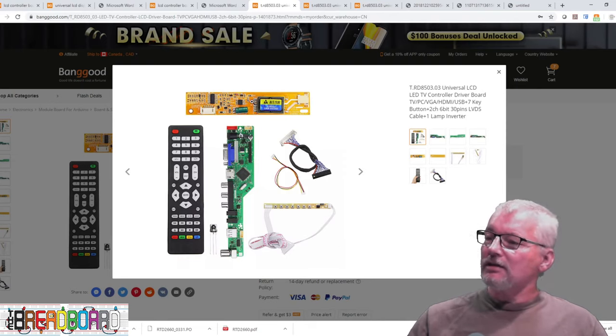You just plug in a USB stick and you can do media: pictures, music, videos, whatever. It would form quite a nice little entertainment center. A little one for camping — you could probably run this off a battery since it's just 12 volts. I also plan to use this with model aircraft quadcopter equipment that has cameras with composite video output transmitting over a 5.8 GHz link to a receiver — this would make a great monitor for FPV cameras. In a future video not too far away, I'm going to build a demonstration of how you could use one of these for FPV camera monitoring.